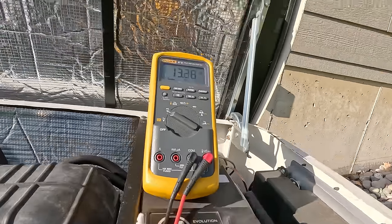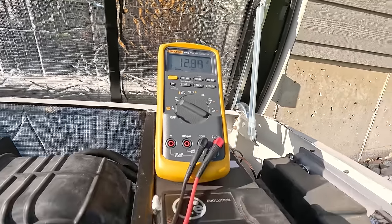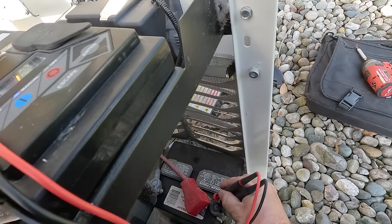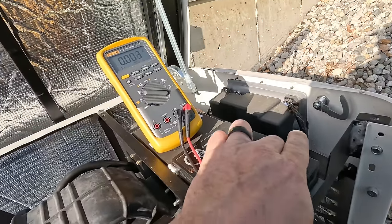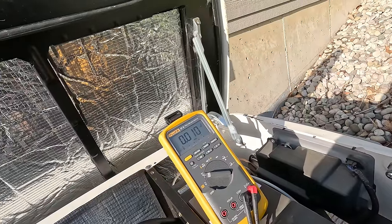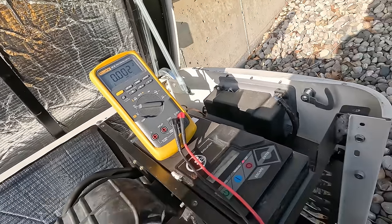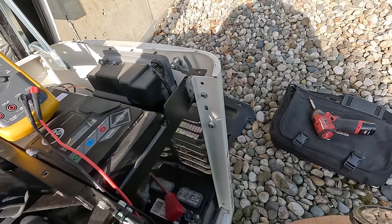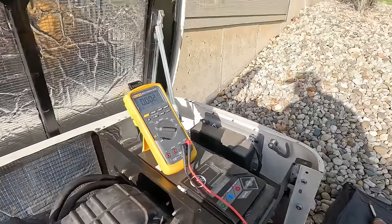Off, enter, manual. There it didn't drop. Now we're going to check between the center conductor of the battery post and the battery. We've got some fluctuations there. So we're going to go off and hit go. Look at that — when we moved that battery post, it started to work. So like I said, we've got issues with battery posts. They need cleaned up.